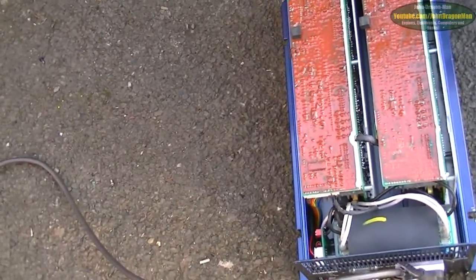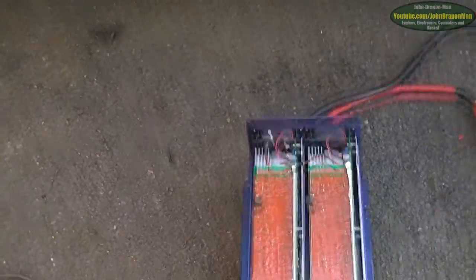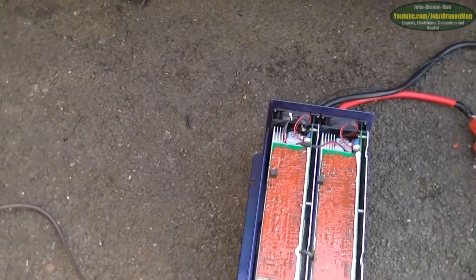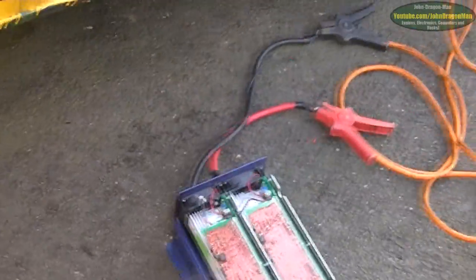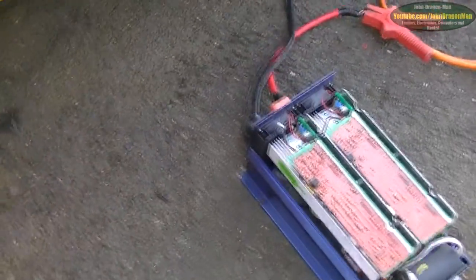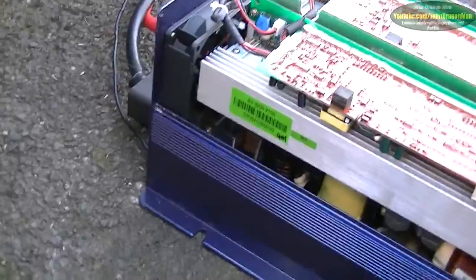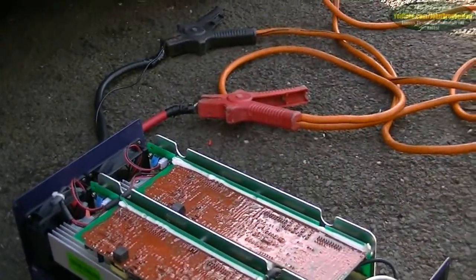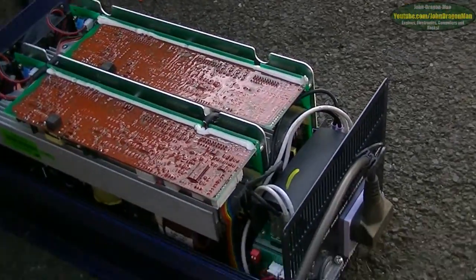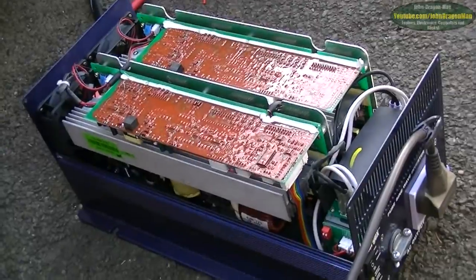So does anybody know how I can fix this? I've had window inverters come to me with this exact same fault where they'll come on but then the overload protector kicks in and that's it. Every time I've just said I can't fix it — it's the one fault I can never do. So if anybody knows how to fix this problem with them, it's a pain. Personally I absolutely hate the high frequency ones — give me a low frequency inverter any day, they're more easy to fix. Yeah, if anybody knows how to get this thing sorted out, please let me know. Thank you guys and girls, peace out and I'll catch you on the next video.